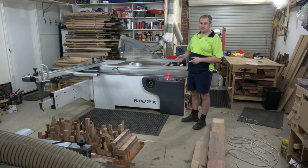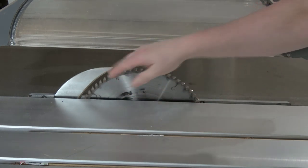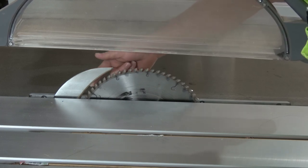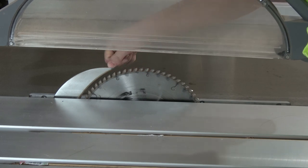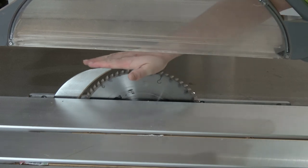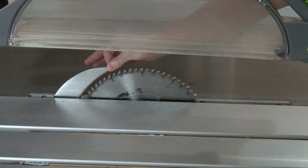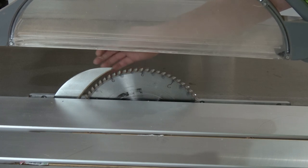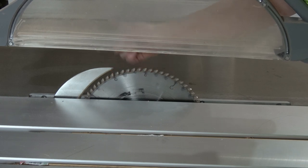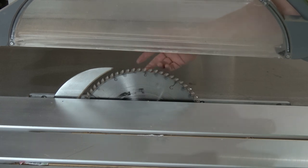It's a TZ series panel saw, equipped with a 12-inch diameter saw blade as well as a riving knife. You'll notice that the riving knife is close enough to the saw blade that my fingers don't actually fit between it — that's an appropriately set riving knife. The top edge is slightly under the top surface of the saw blade so I can still make grooving cuts over the top of it. To set these riving knives, it's as close as practicable without actually touching the blade. The general rule is if you can't get your finger in there, it's good enough — about a quarter inch away from the saw blade.